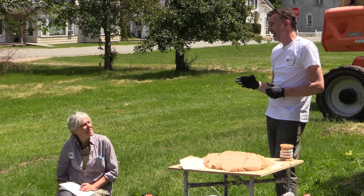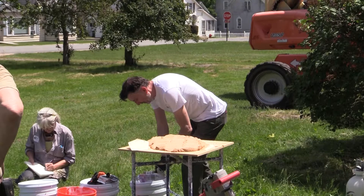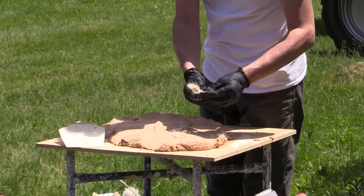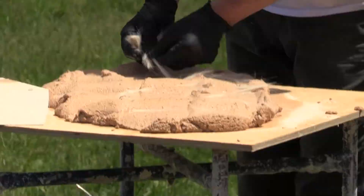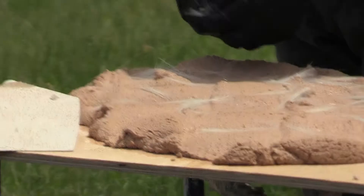Even with a hard hat on, it's going to be interesting. It's a bit of a breeze, so apologies to people who get haired. Basically I just take a little bit of hair like that between my thumb and finger, tease it out — it's not always easy with gloves on. Try to do this on a non-windy day or inside the building. Just tease it gently over the surface of the plaster.